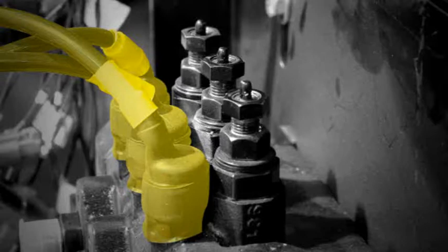Next we're going to check to see if the solenoids that are controlling the troubled valve spool section are working. To do this, we're going to switch the meter onto the resistance scale and measure the resistance across the same pins that we used for testing the output voltage. I'm expecting these to read around 47 ohms, although a variance within 3 ohms is common. The point of this test is to look for a reading that's drastically different than the others, so testing the resistance across functions we know are working provides a good comparison.